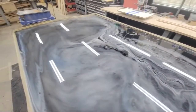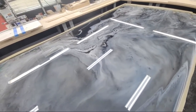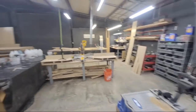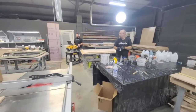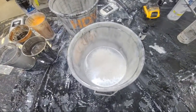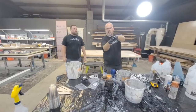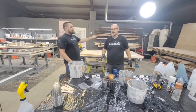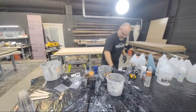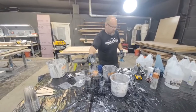I got bronze, orange, black dye, and white powder. How would you do a waterfall edge on a kitchen countertop? I'd pour it in one piece — miter it, biscuit, glue, mock it up, let it dry, install it. Don't try to pour it in that shape — it'll never look the same. Simple to say, not simple to build. If you haven't built anything, don't start with a waterfall edge.